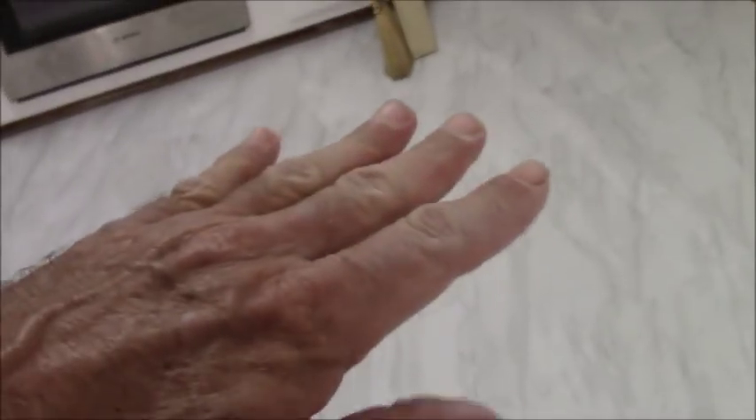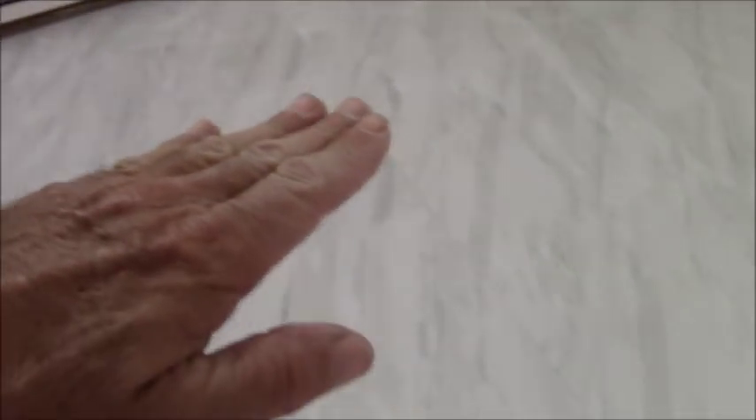The grouting process is finished. There's a little haze on the tile. It's best not to try wiping off the haze while it's still wet — if you sponge it again you're just digging into the grout line and pulling grout out, going backwards. Wait until all the grout dries the next day, then use a soft cloth or old t-shirt and wipe everything off. You could mop it, but that introduces water and delays sealing. Sweep off all the sand particles — it's sanded grout — and once that's done you can move forward with sealing.